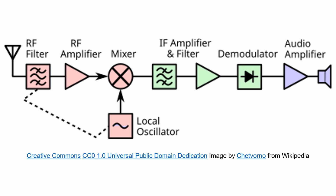Standard intermediate frequency used is 455 kHz for common medium wave amplitude modulation AM radios. Usual IF for FM is 10.7 MHz. Licensing authorities will avoid assigning intermediate frequency to broadcast stations to avoid interference in receivers. In the diagram, red parts handle the incoming radio frequency signal, while the green parts handle intermediate frequency. Blue parts handle the detected audio signal.